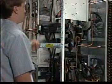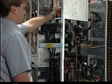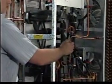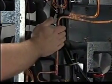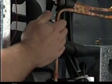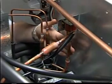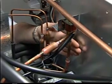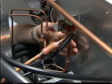If the evaporator is not warming up, the first place to check is the hot gas valve. Lightly touch the discharge line to see if it is hot. If the discharge is not hot, there is an obvious refrigeration problem and you will have to troubleshoot the system using basic refrigeration practices. If the discharge line is hot but there is no heat coming from the outlet of the hot gas valve to the evaporator, you should check for coil voltage.